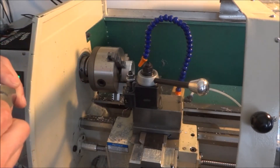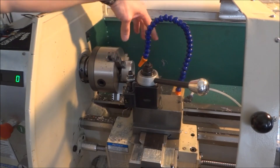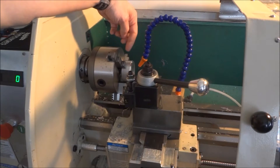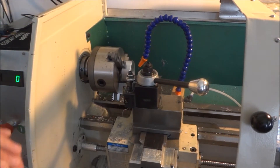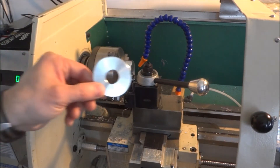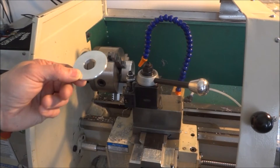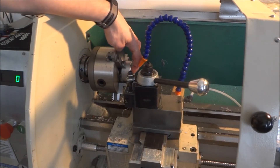The piece of stock I had only could give me two. Had I had a long piece of stock I could have turned three and parted them off, but because I had two short pieces, I'm going to turn it, flip it over, and turn another piece to get my parts. Then I'll cut them with the bandsaw and clean the back side up. I don't have enough room on the stock to part it, so doing it this way lets me utilize the stock I already had so I don't have to buy any.